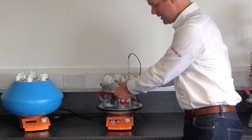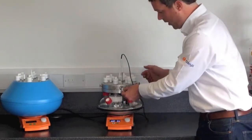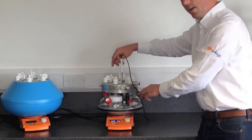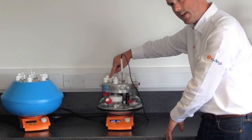This is the reflux head. It replaces the traditional condenser — you have cooling water running in and out via the quick-release hoses, and that runs all the way around the block. There is a central supply for inert gas which runs out to all six flasks and connects via the EasyOn cap.